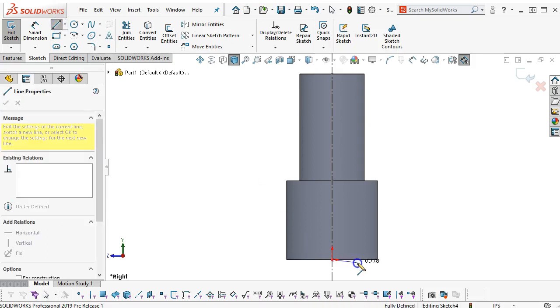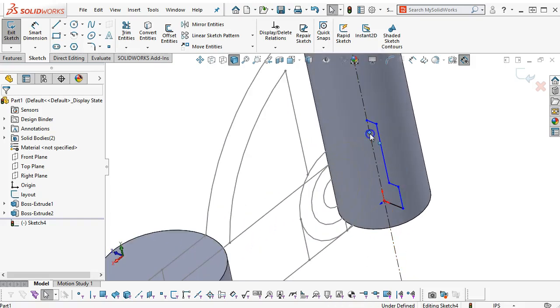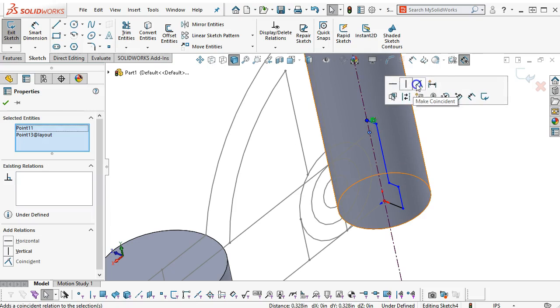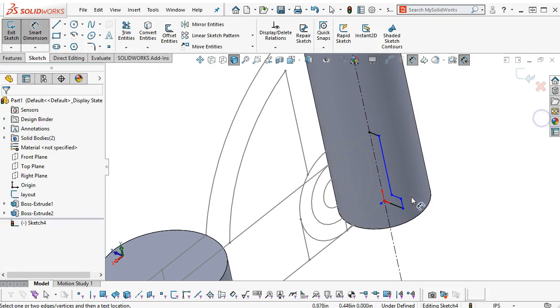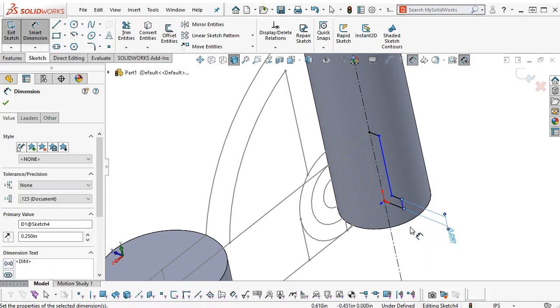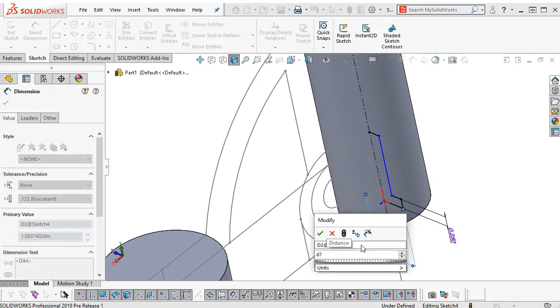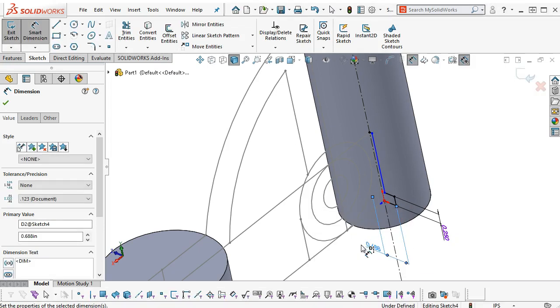So come over, up, and back, and then bring it to the center line. Okay, and then that is the 1.88, so if we make those coincident, that'll set the height. We have a 0.25, and our distance 0.688, 11/16. And then the web distance, I think we were still given 0.25 and 0.25.